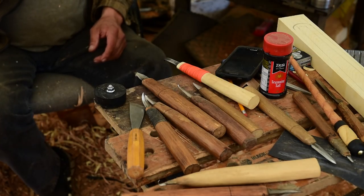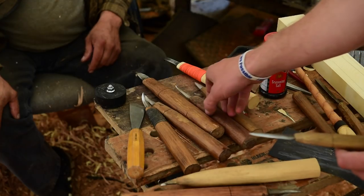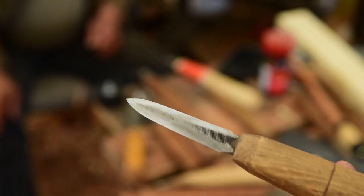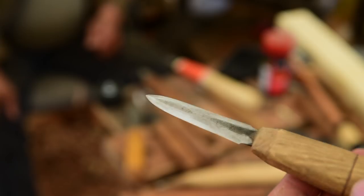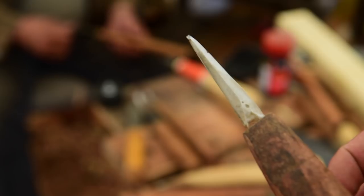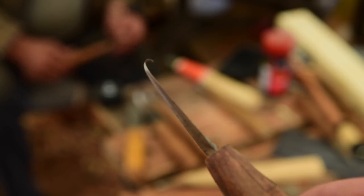Let's take a look at some of these carving tools — they're very crude in form but man do they have an edge on them. There are some really neat little hook blades here. What do you call this one? It's a double-edge shaping knife. It works similar to a European-style paring or chip carving knife. They use this to cut all the outlines for their work. A lot of native carving is relief carving as well as sculptural three-dimensional form. And here's a little hook blade used for texturing, getting into small nooks, and getting your contours and curves properly.